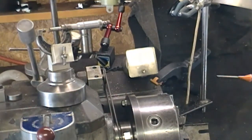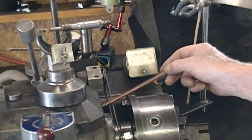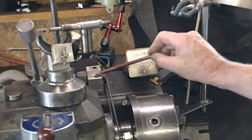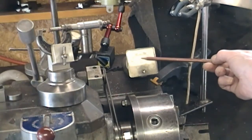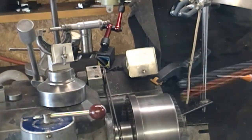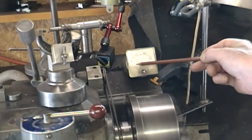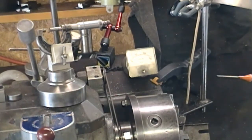The figures I had for this machine before were based on 50 Hz, and now it's running on 60 Hz through an auto transformer. My previous attempts to get fairly accurate revolutions used a setup where I got a drive band off the spindle going to a little generator that makes a very low voltage, feeding a meter marked in RPMs. I've had to play around with the resistor shunt to try and get a usable reading, but it's not accurate. It's set up for 300 RPM which is too low, and the problem is it's nonlinear — it's accurate at the low end of the scale, but as speed increases it just doesn't cut it.